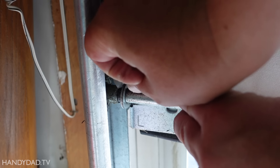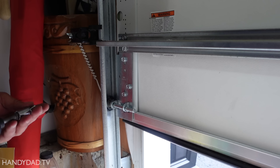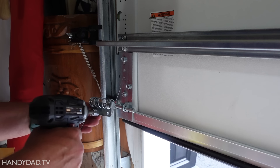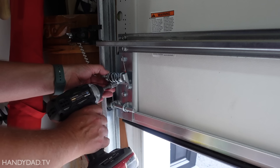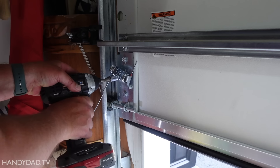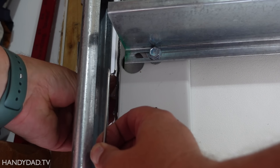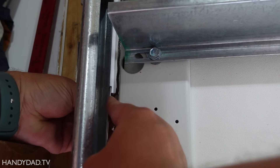The first step is to insert these little white spacers on the wheels at the bottom of the door. The spacers are needed to make sure that the little spring arms don't get pinched by the track. The spring brackets come with self-drilling screws. I installed them into empty holes on my roller bracket to make things easier. The spring gets attached to a nylon loop that goes around the door cable. These get installed on both sides.